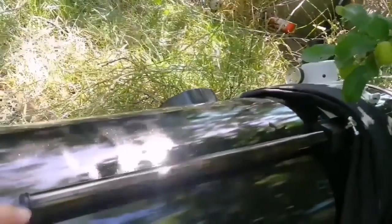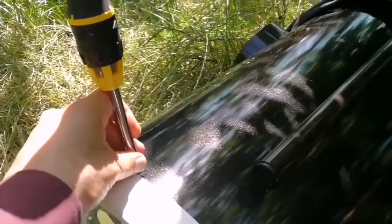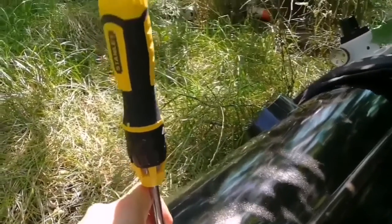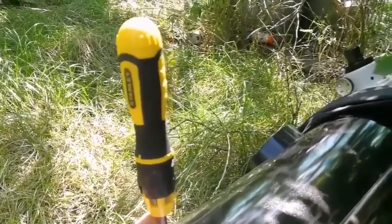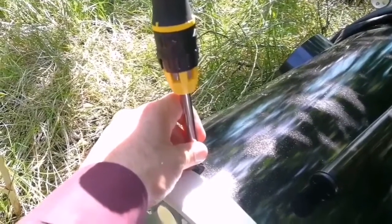which is that side, the eyepiece side, to the right of the eyepiece beam. So this is the mark I've left here, and I'm now going to open it by removing these screws from here. Let's do it. For removing the screws, I'm careful. I hold the tip of this with my hand, and with the other hand I turn the screwdriver. So the tip of the screwdriver is in my hand. I'm careful that it doesn't scratch anywhere else.